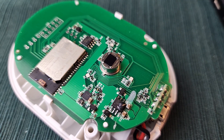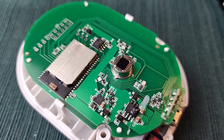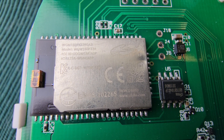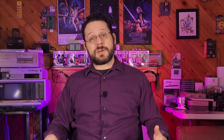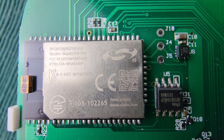So now you know how this device gets all of its information. It has a temperature sensor, an accelerometer, a photoelectric sensor, a passive infrared sensor, and some memory. But what about processing and a kernel of some kind? It has a web server with an interface and does all kinds of timer-y stuff. Well that brings us to elephant number two: this big silver thing. When I opened this device, I thought it was the system on chip. Then I looked up the base model and discovered it's a WiFi module. I was puzzled by the lack of any microcontroller, but then I searched the entire model and discovered there is a Cortex-M4 72MHz ARM processor in here. It has 512K of RAM and 2MB of flash memory on board, which is why they wanted the extra 16MB — they probably needed a little more, and you can save scripts on this device, something I'll cover in a future video perhaps.